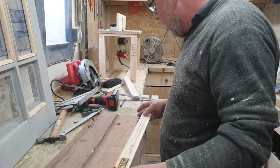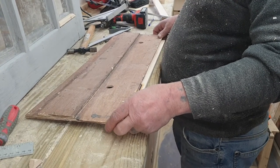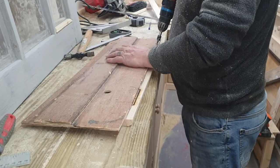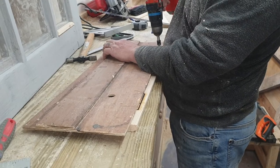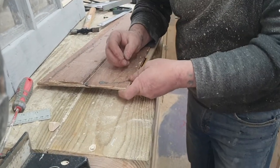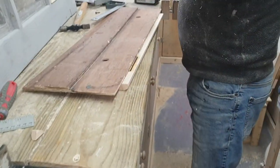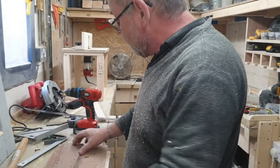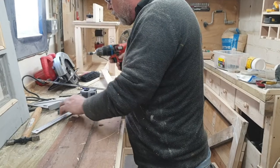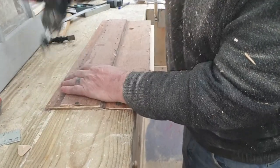Once I've got my lines marked up, this is my cutting guide. I will put it where I've marked up on the edge. I have no choice but to screw it there as I haven't got a proper table holder. It's still marked up on the lines — make sure this end is too. Now screw that in. Because I don't want this to move while I'm using the circular saw on it, I screw my guide to the workbench. That means when I use the circular saw on it, it won't move.